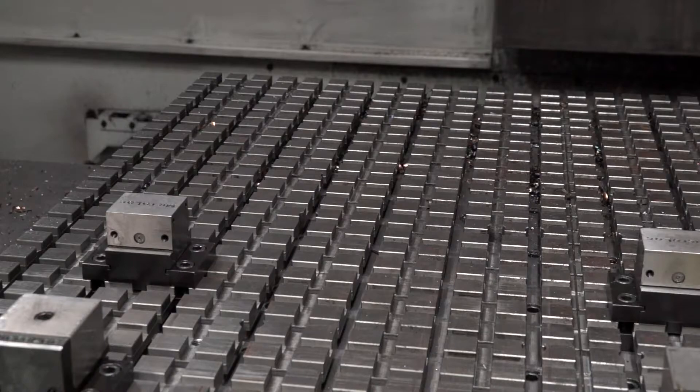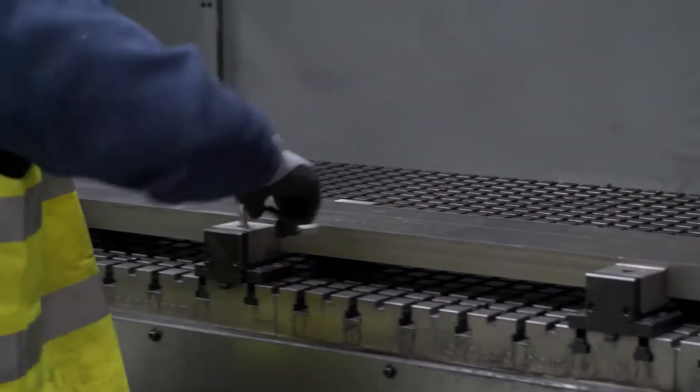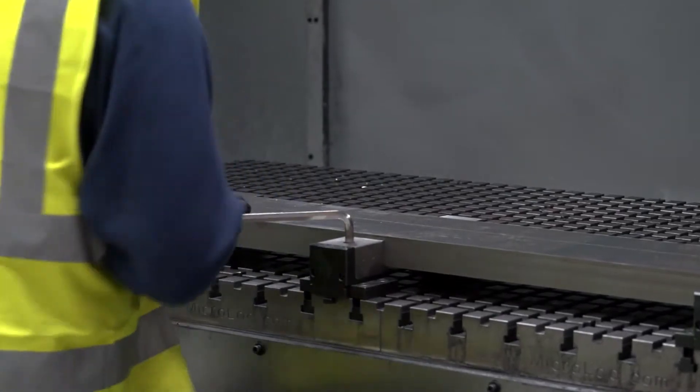It makes the programming a lot easier and a lot quicker. We gain advantage by keeping a lot of flatness on our EDM machines — we use magnetic beds and it causes a problem. With the Micro Lock we can get a dead flat first face to work from.